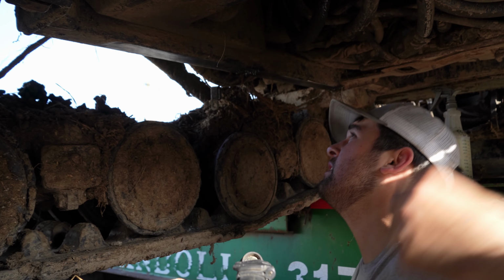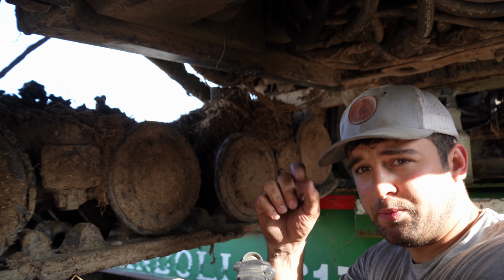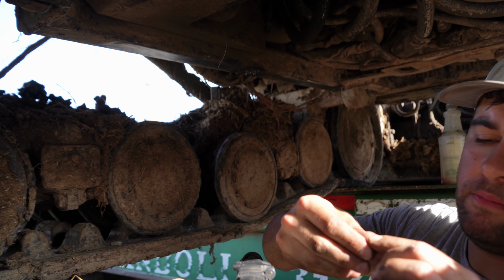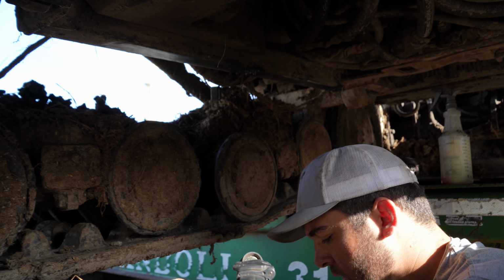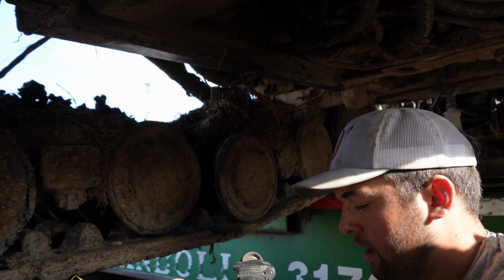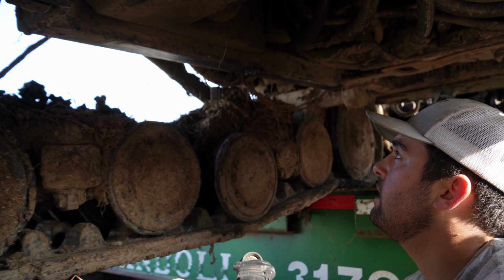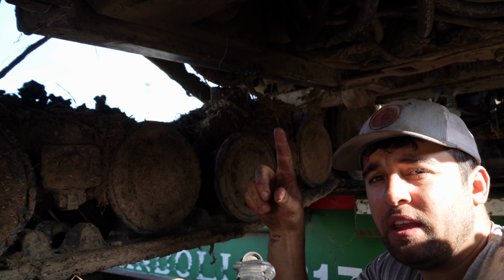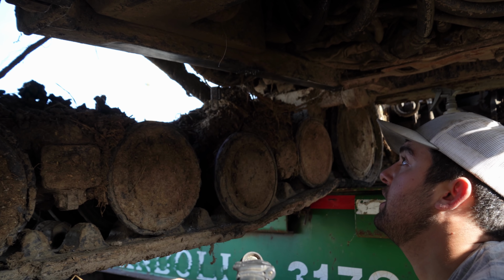I don't know if you guys could hear that or not, but if you heard that little tink, that was that spring inside that cutter. I told you guys earlier the cutters are hollow. You guys can see that. There's a hole inside that cutter, and inside that cutter is almost like a center punch, and it centers you up in your hole. In case you were wondering how you could center up a bit that's flat, it's got a little center punch that comes out that hole. That's where your coolant comes when you run coolant, and it applies constant pressure on what you're trying to cut out. So as soon as it gives way, that spring, that center punch will kick out and push out whatever you're cutting, and that's what it did here.